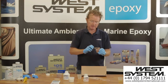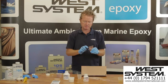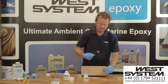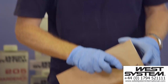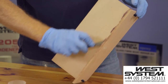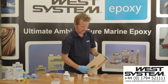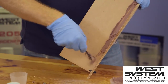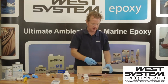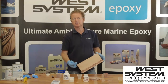Fillets are really very much part of the aesthetic of a modern wood, plywood, epoxy construction. So it's very important to keep them nice and neat. Now what you can do, with a nice clean mixing stick, is just take a nice amount on your mixing stick and apply that to our fillet joint. And the first step is to get the material in place. It's quite a good idea to do this and use up all the material and then come back and tidy it up. That way it will give you far more working time.